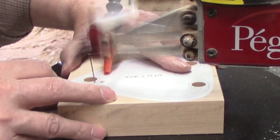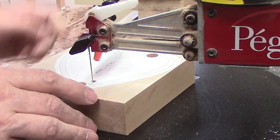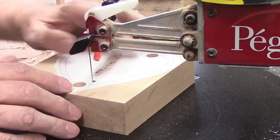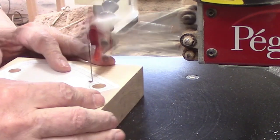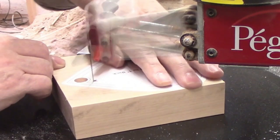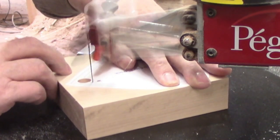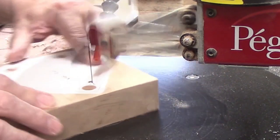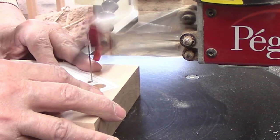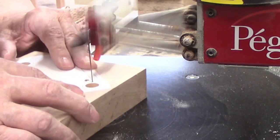This is 1 3/8 thick maple, so due to its hardness and thickness, I chose a number 12 Pegas modified geometry blade. If you're new to scroll sawing and want to learn more about how to choose the right size blade for each project, I'll leave a link to my video on that subject on the screen and in the description. It's difficult to make tight turns in thick material with a number 12 blade. I considered using a number 9 blade, but that would lengthen an already very slow process. Instead, I'll use some tricks I've learned over the years to get the job done faster with the larger blade.